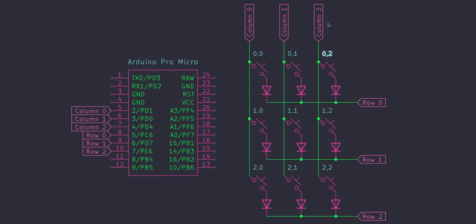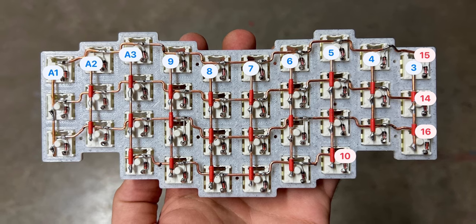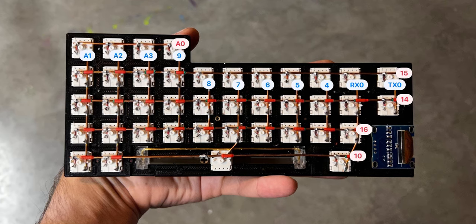Hence this '1,1' here or this '0,2' — you can see row zero, column two. It's listening for that, and once it detects a connection, it records the X and Y coordinate that was hit and performs a key press with that. So a matrix with diodes is pretty simple, and it allows us to make really big boards easily because you don't need an individual pin for each switch — just enough for your columns and rows.